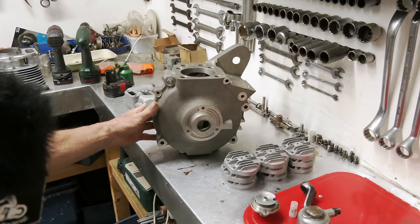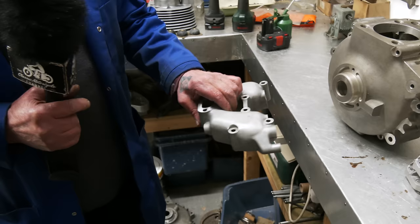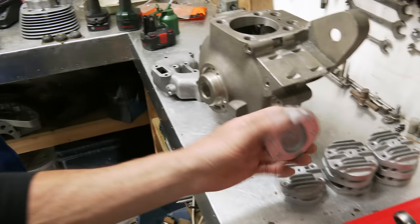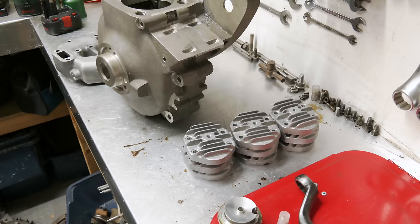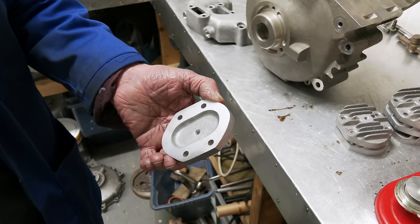Finding anybody to make this stuff now is very hard because manufacturers want to make 100 or 1,000 at a time. In here we've got a pair of crankcases - the two halves. Phil has had these castings done and done most of the machining himself. These are the rocker boxes - a hell of a lot of work in there. There's also a sump plate that goes on the bottom of the engine with a drain on it. Phil doesn't put a magnet in them because he thinks a magnet attracts all the dirt right to where the oil pump picks it up.